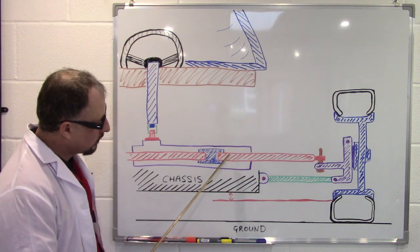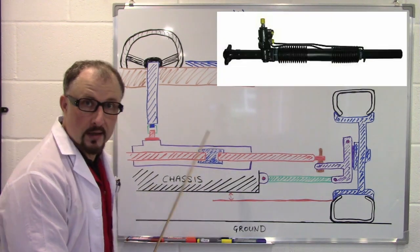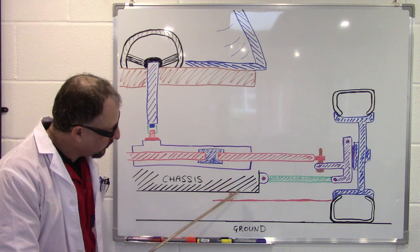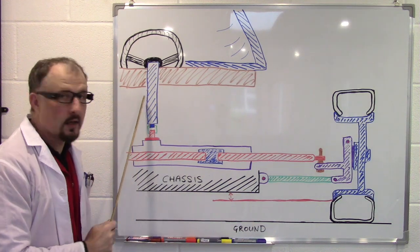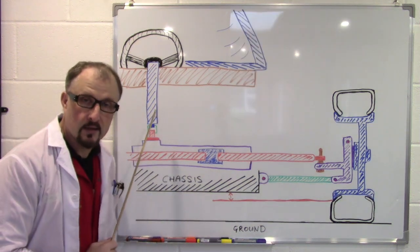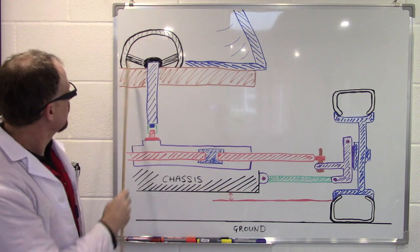So, this parallel steering arm puts the steering rack in the correct position. So I'm hoping you can see that all these are pretty much fixed. Then you've got the coupler here, and then you've got the steering column itself. Now again, this is fixed. If you're taking it all from the same donor car, these are all fixed measurements.